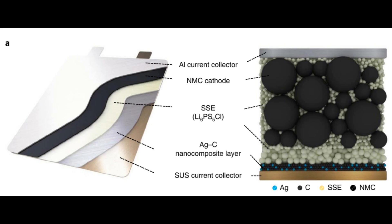This is a diagram of the battery cell layers provided in the research paper. The Samsung battery uses an aluminum current collector and an NMC cathode material, both of which are common to typical lithium ion batteries. The NMC is shown as the large black spheres that make up the central part of the diagram. NMC is a common high energy cathode material that's well researched, and for that reason it provides an excellent benchmark material for testing high energy battery cells. Aluminum is shown as the metallic coloured strip that forms the top layer on the diagram, and is used as the current collector because it's electrochemically stable at the voltage ranges that lithium based batteries operate at.